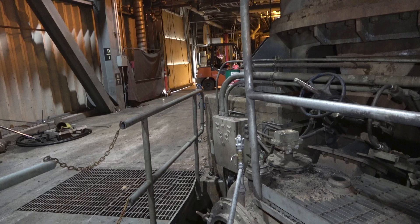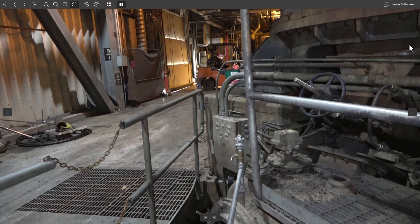This shows the pyrite hopper. This would be the flop gate. Here's a valve you close when you open up the pyrite hopper. Your scrapers sit up here — any rock or debris that doesn't get pulverized drops down the air box. The scrapers bring it over and drop it down the chute to the pyrite hopper.